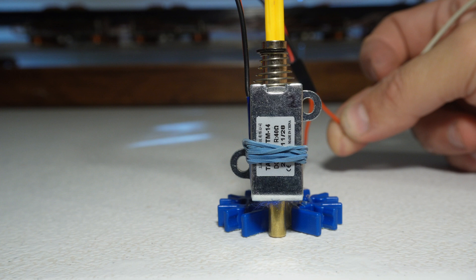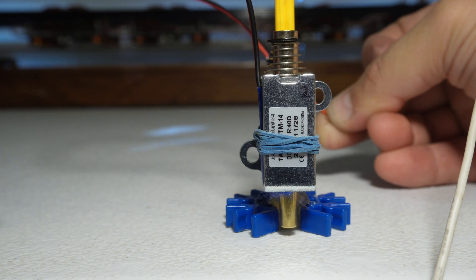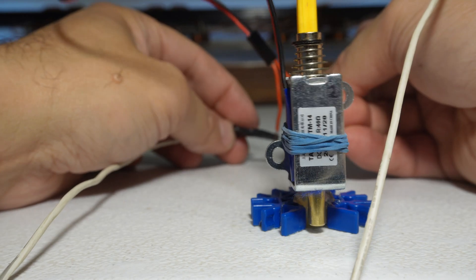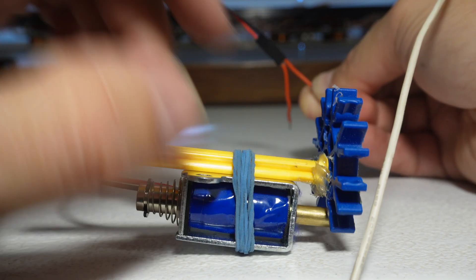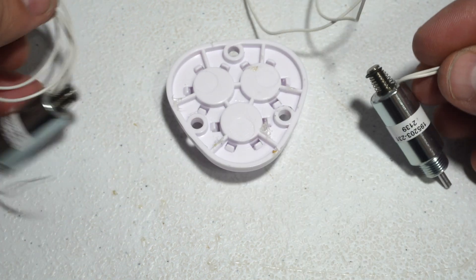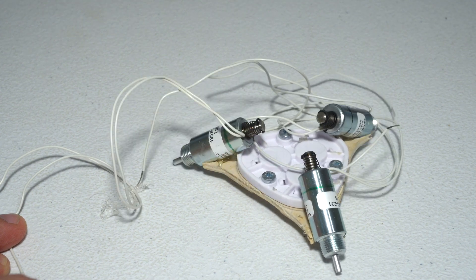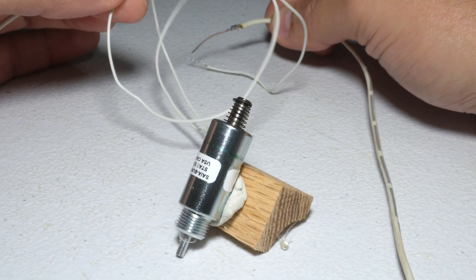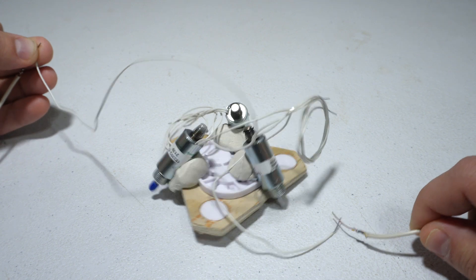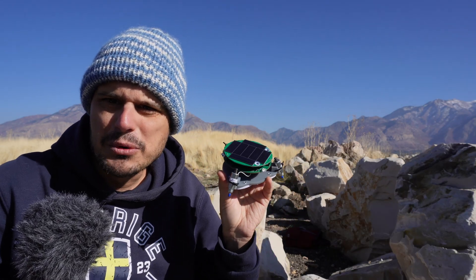From experience, if you start with the solenoid already touching the ground it won't be strong enough to eject, but if you start it a little up off the ground it'll strike with a good amount of force. So I need to hold these up somehow. I got these rolly ball-bearing furniture caster wheel things — surprisingly well rolly — and my plan is to put solenoids around the base so it can kind of kick itself around. I want this robot to seek light, not just move randomly.